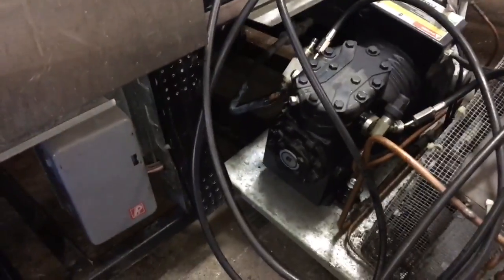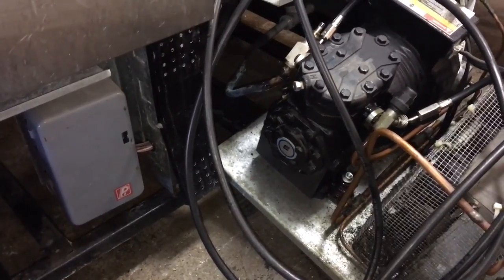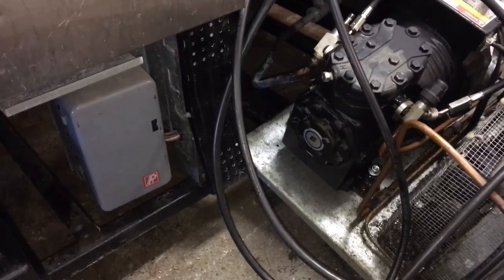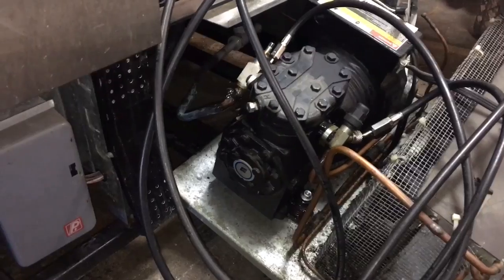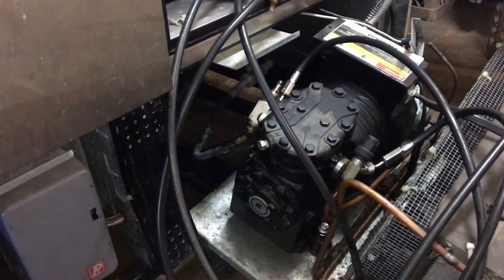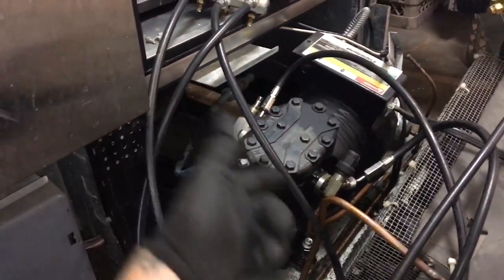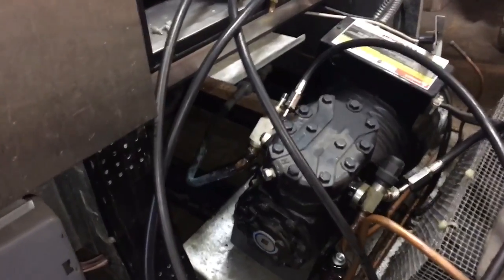Three trips, another company, 3 trips. And they lost all kinds of product at their other place. Didn't even get to use it, and there's your problem right there. It's gonna be a bugger to fix. Have to take that valve off and start from scratch. See if I can sweat a piece up into the valve. After I sweat the stub out, I'll probably cut the pipe back, unbolt the valve, and then start from there. Might as well give it a try. If it doesn't work out, I'll just purchase a new valve for it and then start over and repipe it. It's about all you can do.